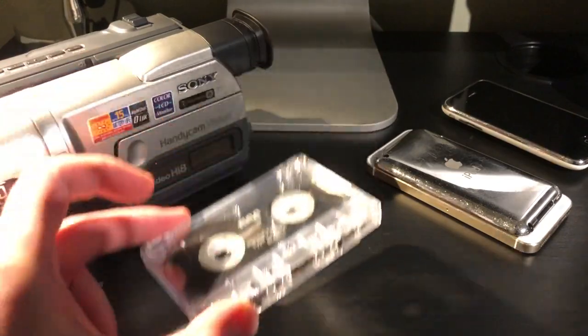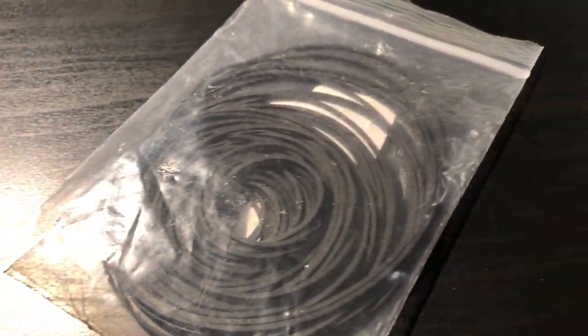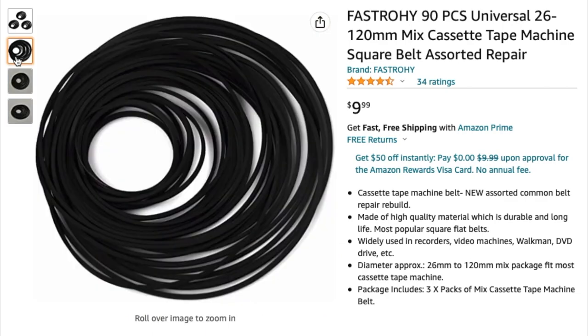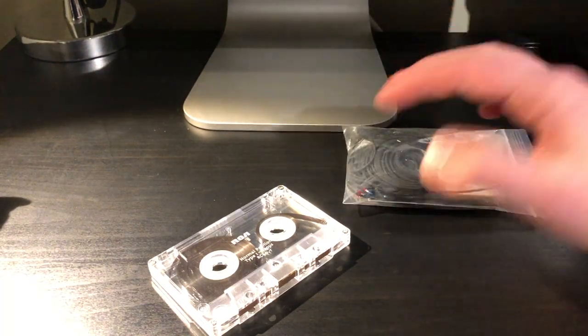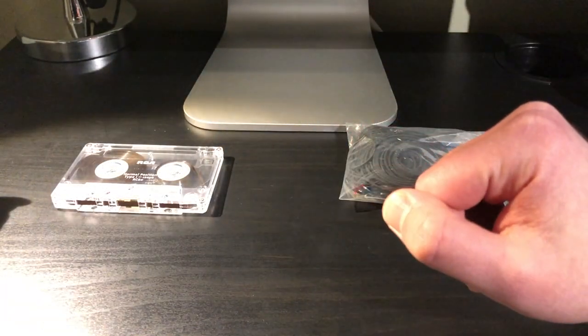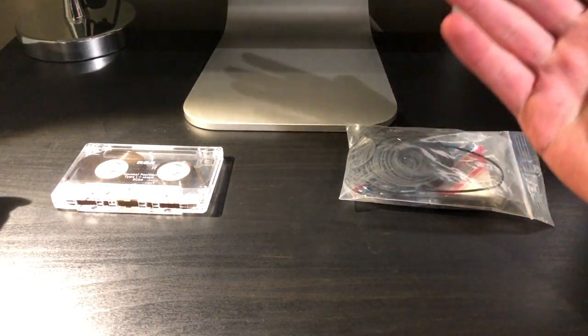What am I actually talking about? It involves the cassette — specifically compact cassette — or devices that use belts. These are some belts I got off Amazon, a 90-pack. This is going to help me bring some of my players back to life, because at this point I have more non-functional players than functional ones. Belts degrade over time and disintegrate, so even new old stock probably won't work unless it's a super high-end direct drive model that doesn't need belts.